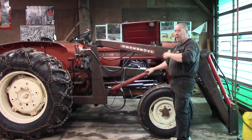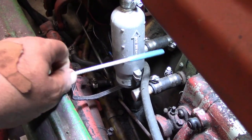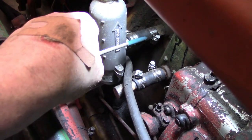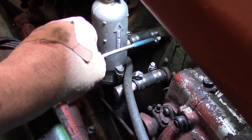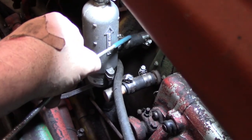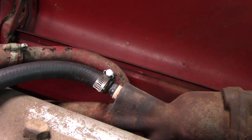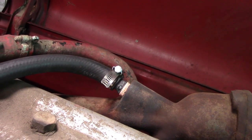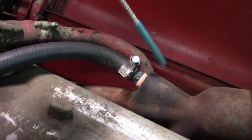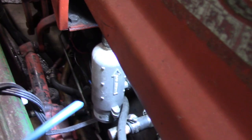One of the first things you can do to fix that is install a proper circulating block heater. Right here is the unit I bought. There's the inlet — try to find the very lowest point on the block you can; you can use the lower rad hose if you have to. I found this port here — it's the lowest point on the block. It draws the coolant out, heats it, and pumps it back up. I put it in right there. It may differ on your machine because you might have different fittings, but I had a port there that I put a hose barb in and ran it there. It circulates the coolant all the way from the bottom, pumps it up, and keeps it going around and around.